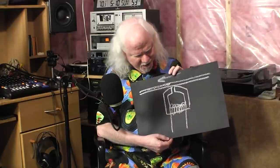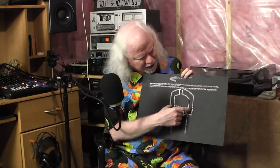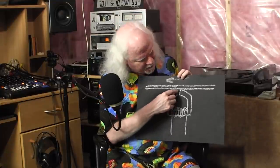So when you run that tape past the head, what happens is the signal comes in through two wires into the head. There's a coil inside — it's like a transformer — and what it does is convert the electrical signals coming from your turntable or wherever you're recording from, into magnetism or magnetic signals that exactly correspond to the electrical signals. Those magnetic signals travel through the core and there's a tiny gap — probably like a micron, I don't know the exact measurement. It's an electromagnet.